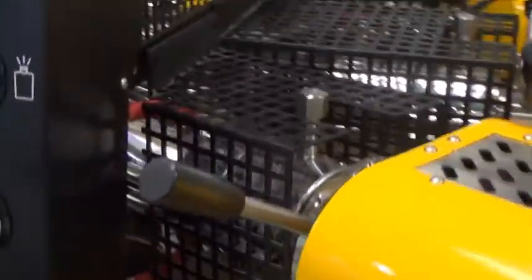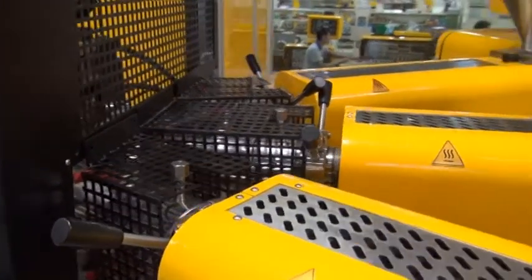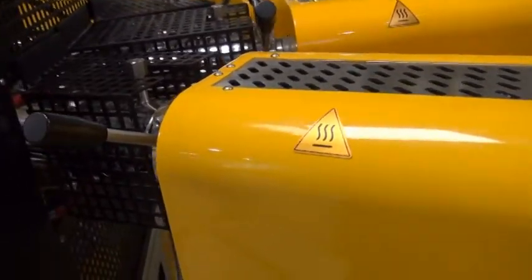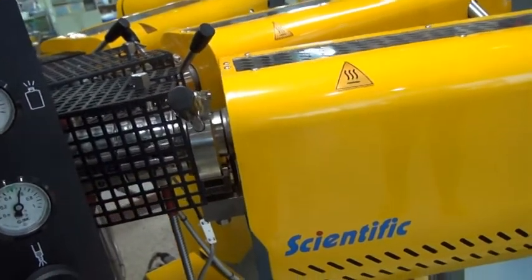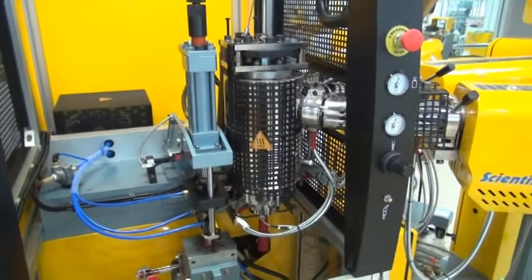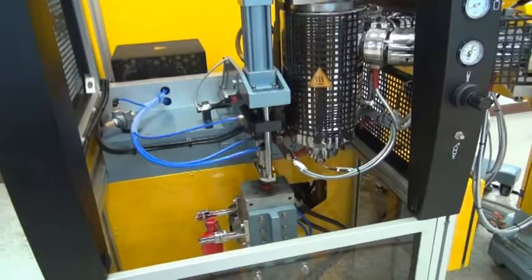And here under the covers you have the adapters. They are also attached here with C-clamps, so it's very easy to disengage the extruders to remove them. It's also easy to move the extruders back if you want to take out the screw, for example, for special cleaning purposes. So here we have the die. It's of course a 3-layer die with a new design, which gives a very even layer distribution. It's perfect for co-extrusion or bottle blow molding.